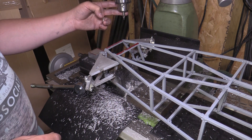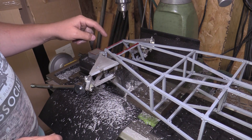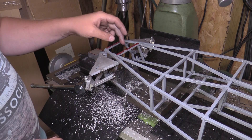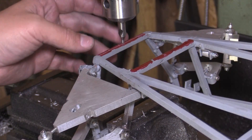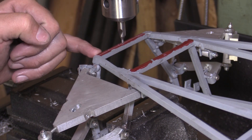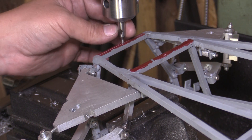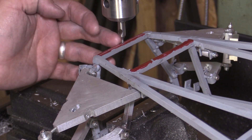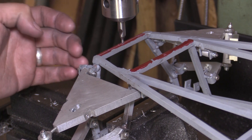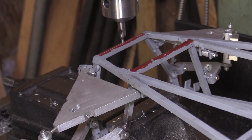I've got the centre drill set up and I'm just going to touch just a little dimple for the 2.5mm drill to follow. We'll be tapping it M3, so the bolts that come through the other side can bolt straight into those cross members. I've put some marking out ink on there, scratched in a centre line on the front cross member in both directions, and centred up the centre drill on that cross. I'm going to do the two front holes in the front cross member first and then come back and do the second set.